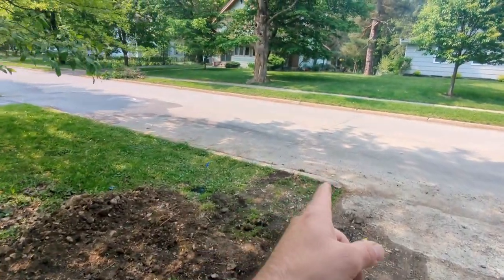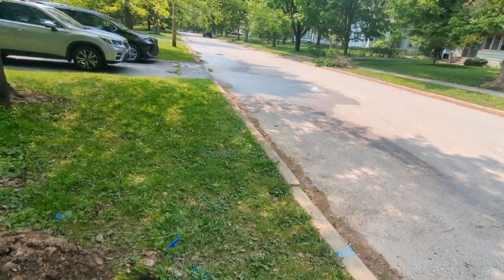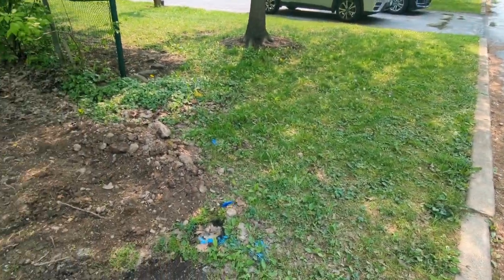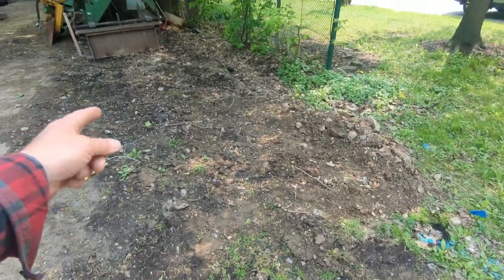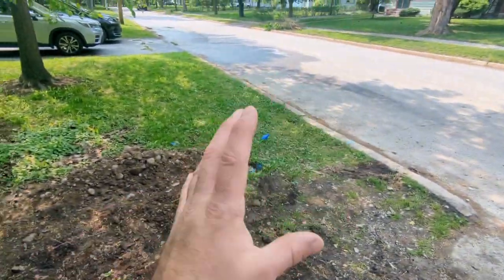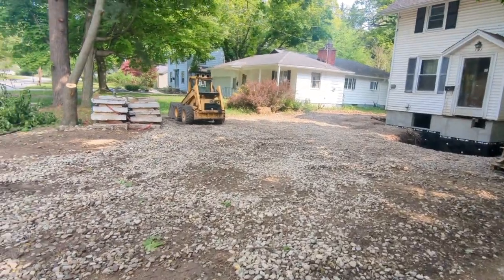We're not doing any road cutting, which is... The sewer's in the center, which is where your manhole cover goes down. But he said right about here, when we had that sewer scoped, the problems with tree roots and everything sort of stopped. And from here into the road, into the town's connection there, looked real good to him. So we're going to pursue this thing over here until, and we're going to inspect its quality or whatever, until we've got a reasonably good idea that the rest of it is nice and clear and open and worth connecting to. And then we'll get buckled into that.